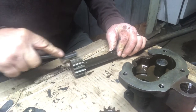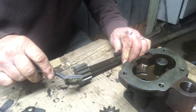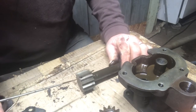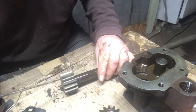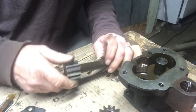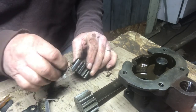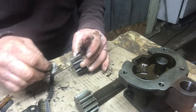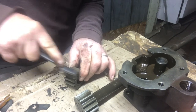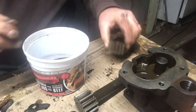This happens to be a brass bristle brush I'm using on this gear. It's got a little pitting in a couple places. I don't know how this is pinned and I'm not going to find out, because there isn't the slightest bit of movement on the shaft, so I'm sure the key and everything is just fine. I'm going to clean the other gear up a little more to get a look at it. This gear has very, very little pitting on it. We're going to give them the first rinse off in a little mineral spirits and see what everything looks like.